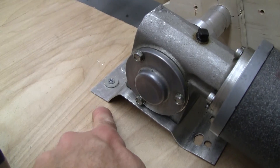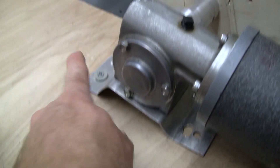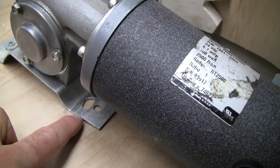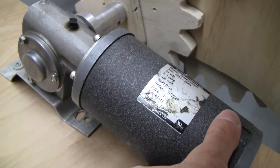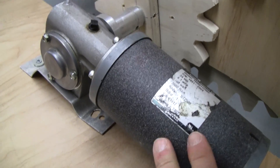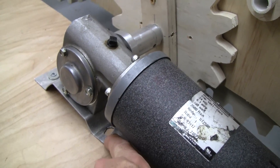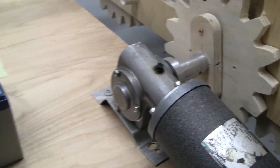The other thing that was happening was with the motor mounts. Right now I just have them mounted to the front, because it's easier to get access there. But when I was going into reverse, the whole thing was flipping up just due to the torque on it. So you have to have both sides down, even if it's a pain to get the screws in there.